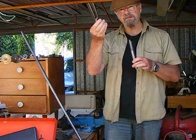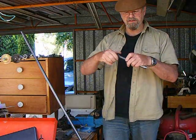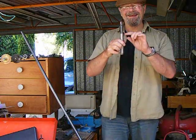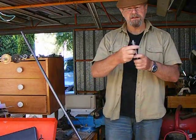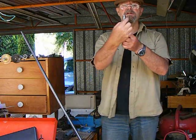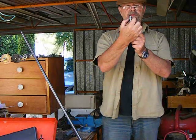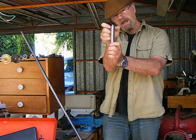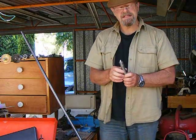You cut that thread down — that's the hard part — and that's 60mm of thread. These jaws are ground to a radius, which I'll show you in a minute, to the exact width of 21.5mm across there. They have to be 21.5mm outside — no more, no less.